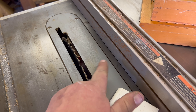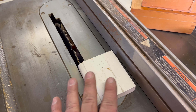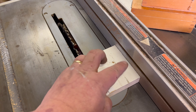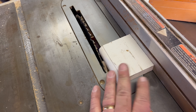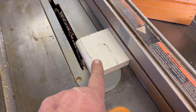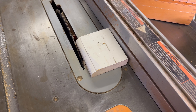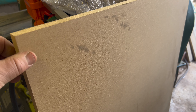Today I'm going to show you how to make a really simple baseboard. Sure, you could just go buy one, but a lot of it is two dollars a linear foot or more, so this ends up a little bit cheaper. This is just three-quarter inch MDF, and to make it you basically just need a table saw, track saw, or circular saw with a fence — whatever you have that can cut straight — and a three-eighths inch roundover bit with the accompanying router.